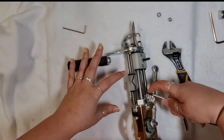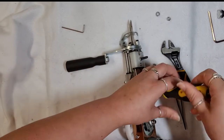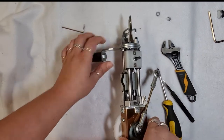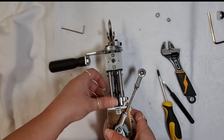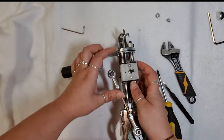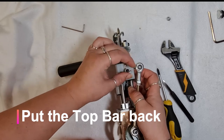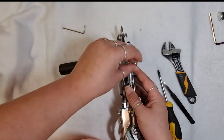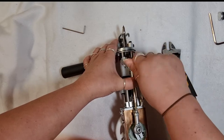Just going to put that screw back in to keep the scissors in place and get it tight. I'm going to put the scissor opener back in but I'm not going to screw it down because we know we're going to have to change it since we're changing the pile height, so we'll just leave it loose. Then I'm going to put these pieces back — the yarn guide, the bar, and this — and we are literally back to cut pile, which was super quick and easy.